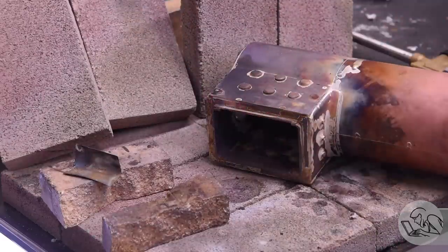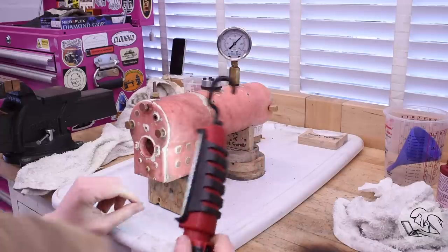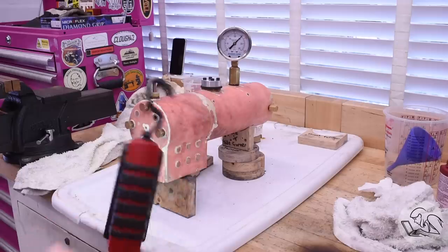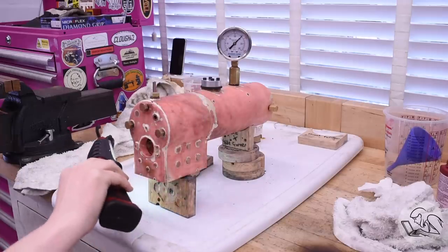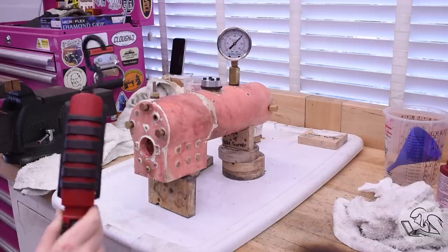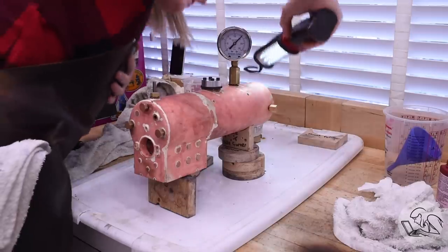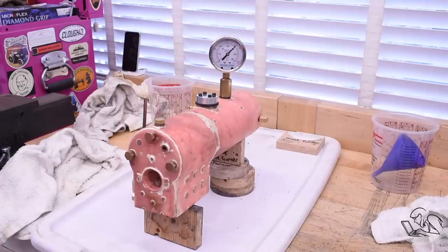You can see how much work the sheet metal is doing to protect everything from the torch. I got that solder to flow and was very careful to make sure I got the right spot this time. No obvious signs of damage, so I let it cool down, pickle, and inspect. This time, back up to 200 PSI - and it's bone dry. That seems to be a good repair, along with the decorative blob of solder that really ties the room together. I'm looking and looking and I cannot find any more wet spots. This thing is just bone dry all over the place.